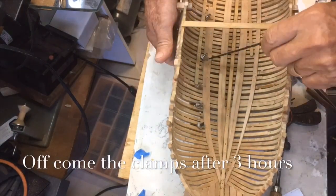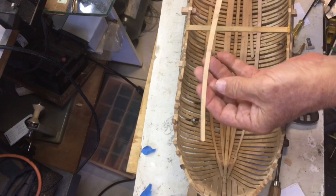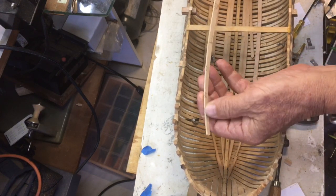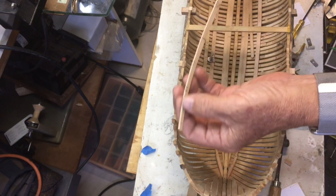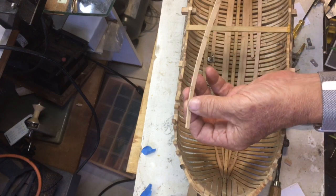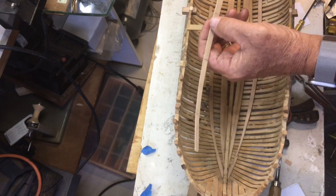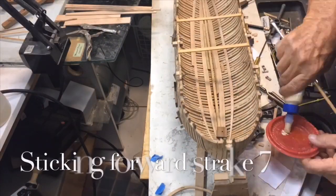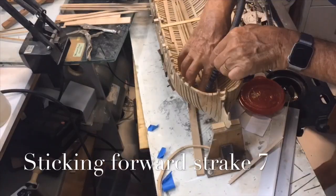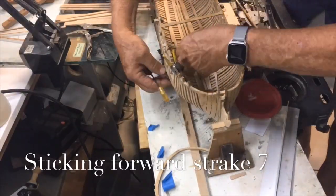Very apprehensive as I take the pieces off, but deep down inside I just know that this is going to work. There's a little scarring here which I can sand off, because I'm going to taper this a bit anyway and take it down a little bit. So maybe I tightened these two clamps a little too hard, but we're getting a nice tight fit there. I feel so much better sticking it — I'm using PVA. I could use anything because the piece has taken the form so very well.